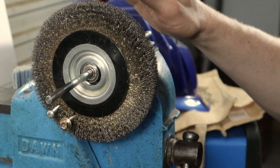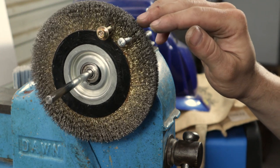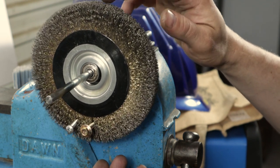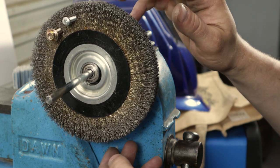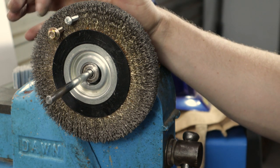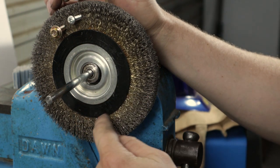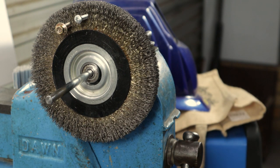Well, after a bit of mucking around and trying different size screws, just wedge it in just to get an idea of how much balance I need, I've found that these two screws pretty much out of balance in any spot. So that's the size of the error. So whatever they weigh, I need to either add that to this side, or if I bring it in, I need to add proportionately more, or clip some out here that equates to the same amount. I'll be back shortly.